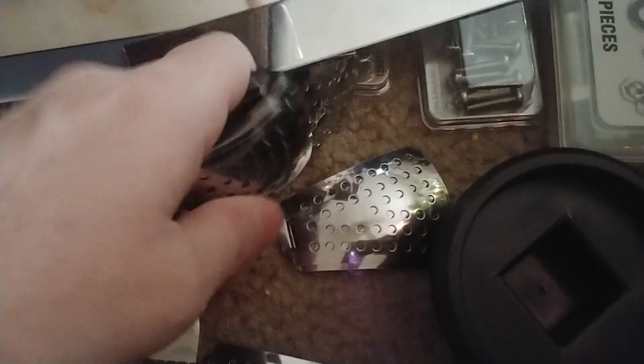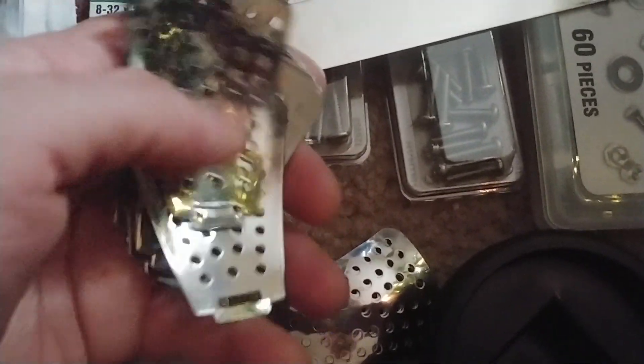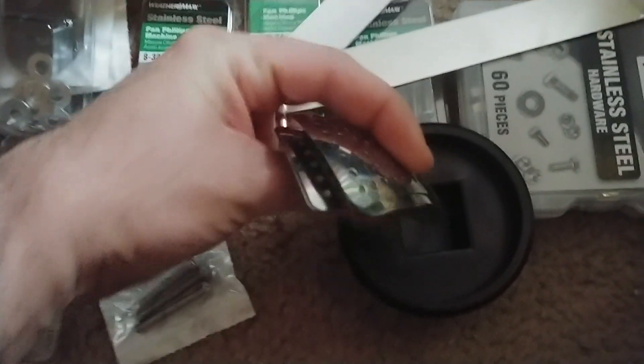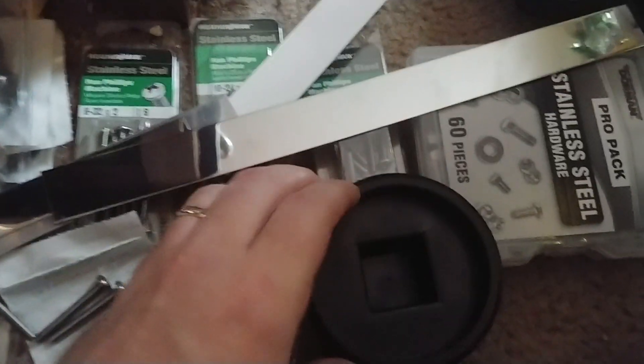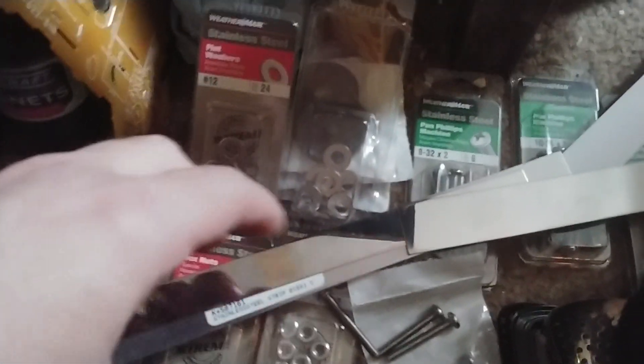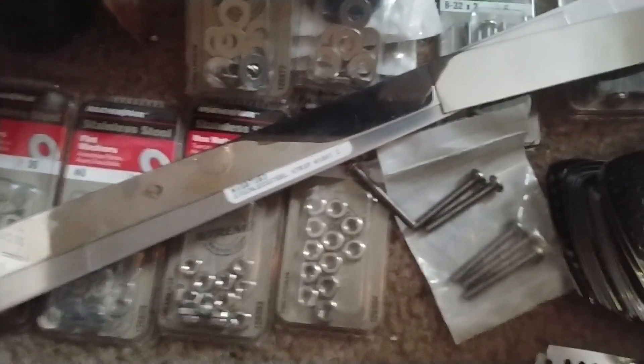I could attach the anode and cathode to the positive and negative leads of my power supply. I'd stack these plates — I'll probably have to bend them at a certain degree to take up as much space as possible within the chamber, with the plates staggered evenly. One side will be generating oxygen, the other side hydrogen. I'm going to use potassium hydroxide as my electrolyte.